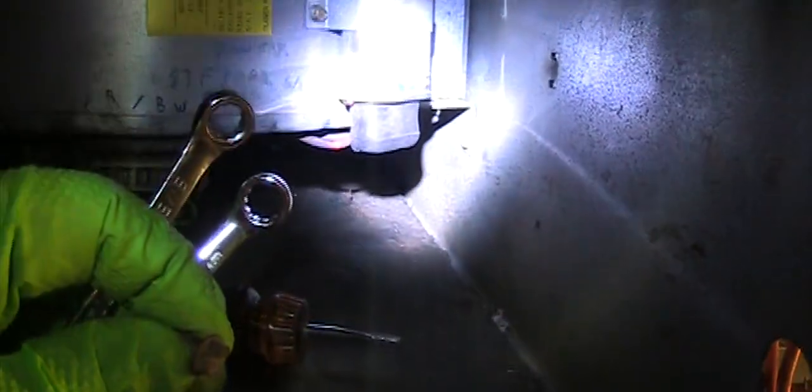I just have to find a good position to locate in a safe location, put it in a safe location so I can remove the motor. So I'm going to pull it out now. Right now, just remove the two screws holding the fan. Very easy. The bottom one, the screw is stripped, so I'm going to use a 5/16 or 8mm. The top one is fine. Okay, the two screws are removed.